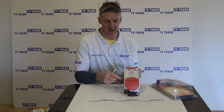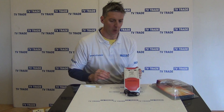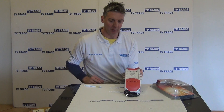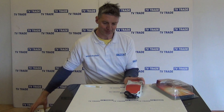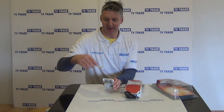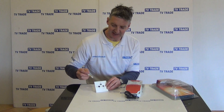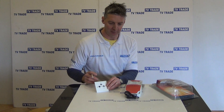You can imagine we just come across using F connectors — compression F connectors — and we connect up to eight different rooms. When we actually run the signal from this multi-switch to the room, it would have a face plate like this, which will have a single cable coming in through the back, and at the front it'll split that signal back out into a terrestrial output and also a satellite output.